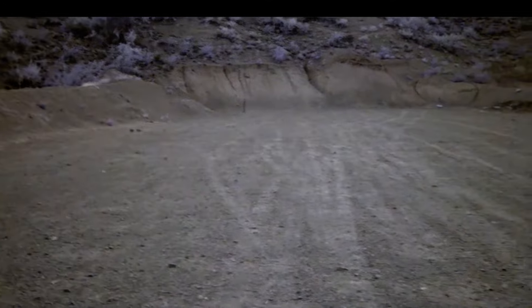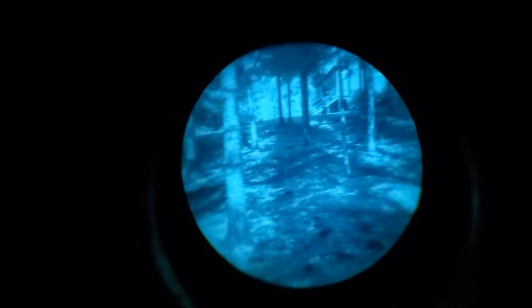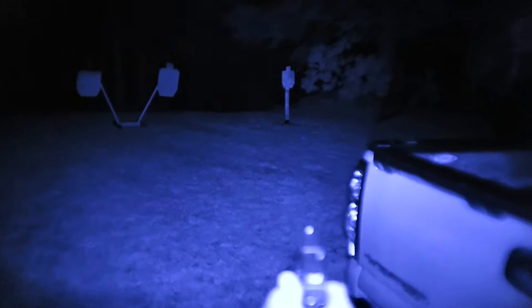Other than lack of low light sensitivity, the biggest problem with digital units so far is that some people report a lagging refresh rate. What this means is that when you move around quickly in a darker environment, the environment you see is somewhat delayed compared to real life. Analog intensifier tubes work nearly at the speed of light, so lag isn't a problem. However, digital units use a microcomputer processor to render images and display them on a screen. Digital cameras also work on frame rate and image exposure time — the darker it is, the longer the camera needs to expose the image. This means that in a very dark environment, the longer exposure needed by digital units can make the lag even worse.